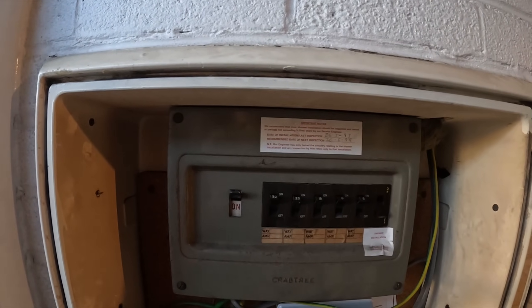We've also got to carry out an EICR at this property — just a certificate so they can rent it out. Let me know down below what your thoughts are on whether an EIC, when you swap a fuse board, is valid for 10 years, and if that has hierarchy over any EICR certificate. I know technically they're completely different things, but I think you can get away with it if it's a new build, less than five years, or a full rewire.